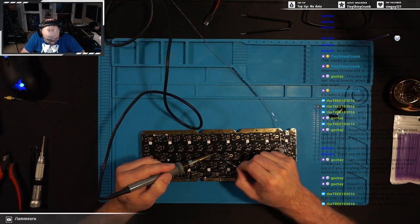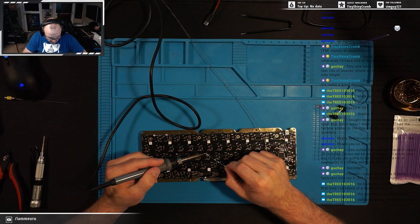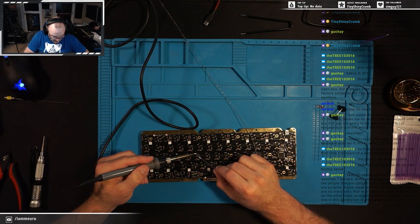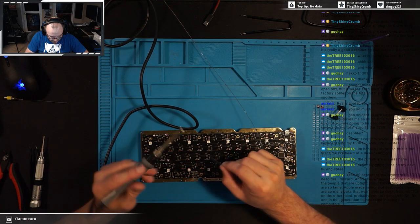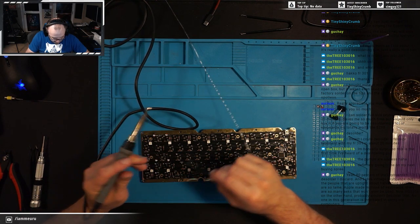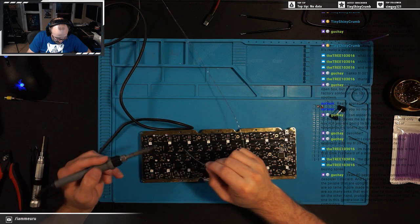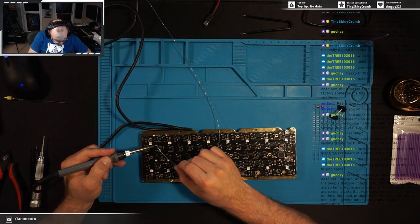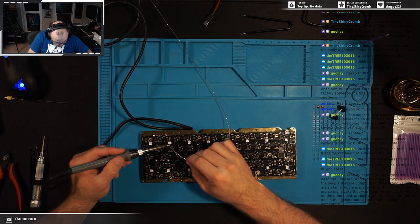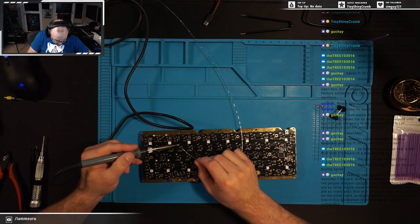Yeah, I would actually argue that your desoldering methodology is more important than your soldering methodology if you're going to be involved in this hobby for any real time. Not methodology, but equipment. Because it's really easy to get decent soldering equipment very inexpensively. There's a lot of options that are worthwhile. But your desoldering equipment, there are way fewer good options. It's basically this one, and then like an 80 to $100 version on eBay if you just want to do a few boards.